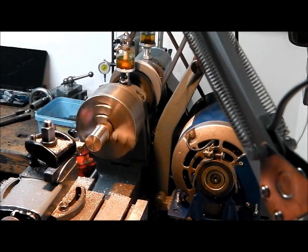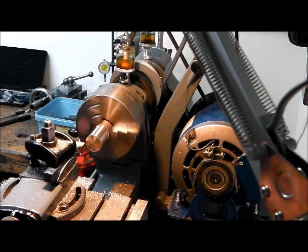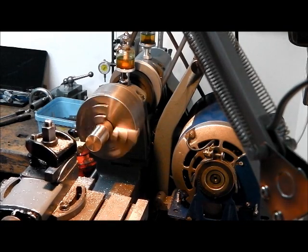There's quite a lot to take off — this was the nearest size bar I could get, so it will take some fairly large cuts, something like 15 thousandths at a time. This is bronze and the HSS steel tool can handle that quite okay, it's just a bit unpleasant.